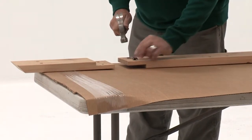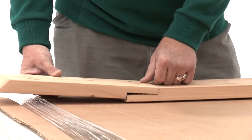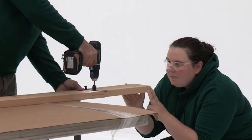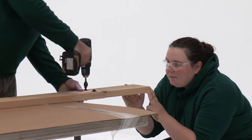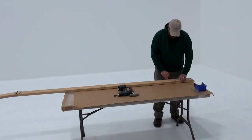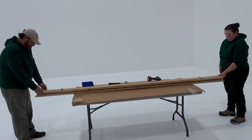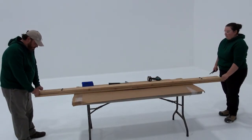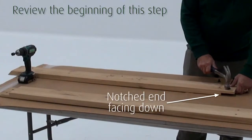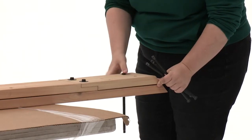Now insert T-nuts into both ends of an inside long beam, flip it over, and attach a beam end on one end using two hex bolts. Get a helper to check the alignment of the boards at eye level, then tighten the bolts. Repeat to attach a second beam end to the inside long beam. Next, place an inside beam assembly onto an outside beam assembly. If the bolt heads are in the way, go back to the beginning of this step to properly identify a left outside beam. Make sure the bolt holes match up and the mitered ends align.